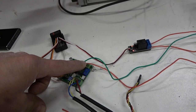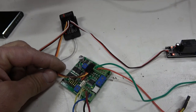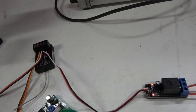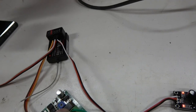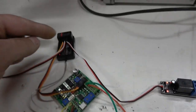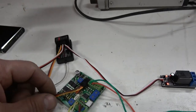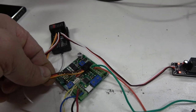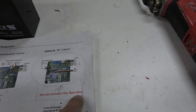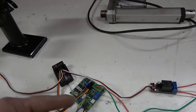You have power coming into the board right here, and then out of it we have a little nine-inch servo extension — female to male. It is very important you do the same thing: we're not powering this LAC board from the receiver, so you have to cut out a small section of the red power lead. It even says it in the instructions: do not connect the red wire. It's getting power from an alternate source.